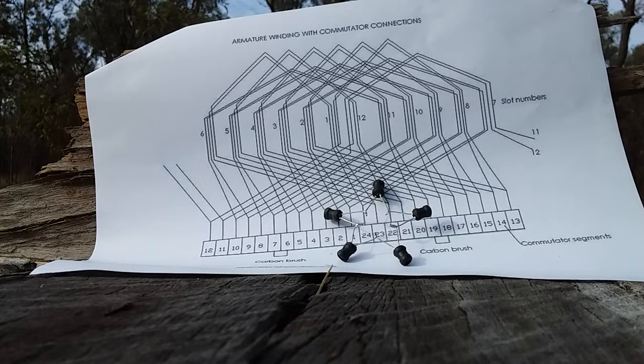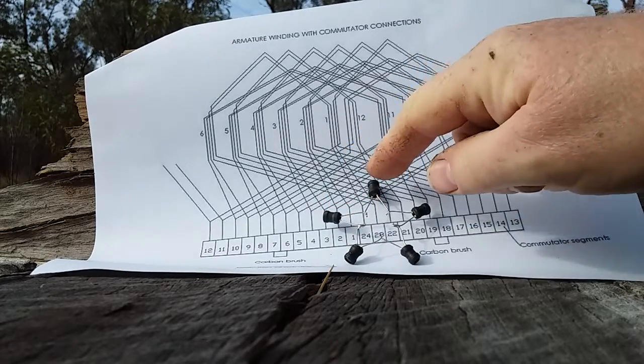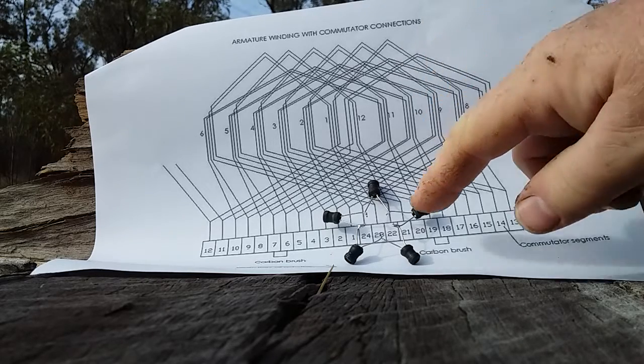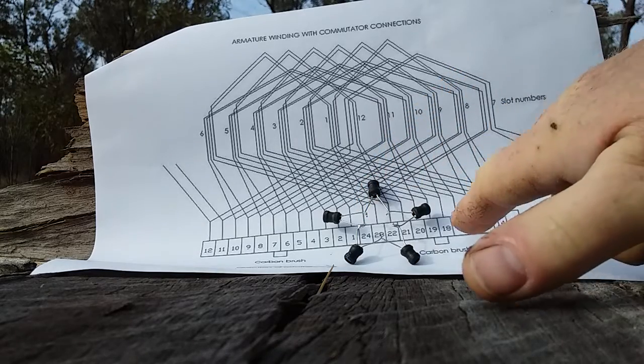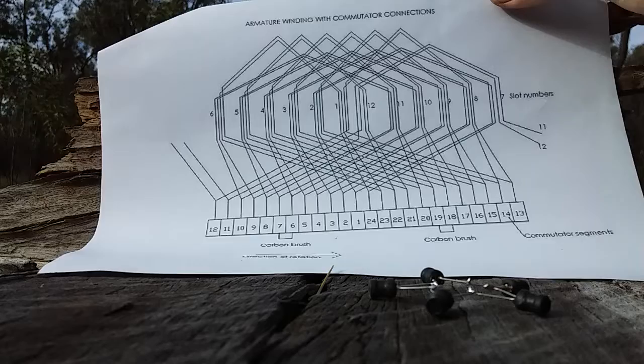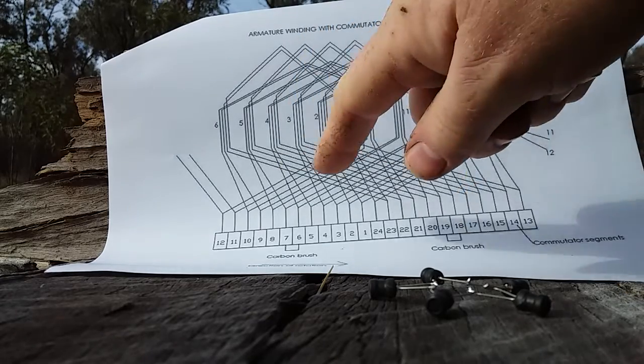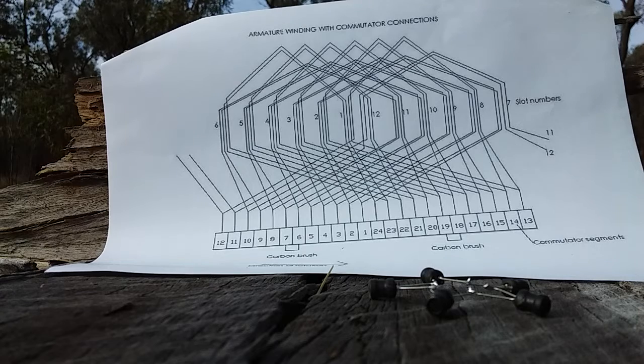You can falsify experiments all day long, and at the end of the day it does not prove the truth. The analogy is: each one of these coils represents a coil on the rotor, and each one of these solder connections represents a segment on the commutator. Anytime the carbon brushes are connected directly across the segments, at any one time there are two coils with the least impedance, least resistance, and maximum current. The rest of the coils share the current, the voltage drop, along the path of most resistance.